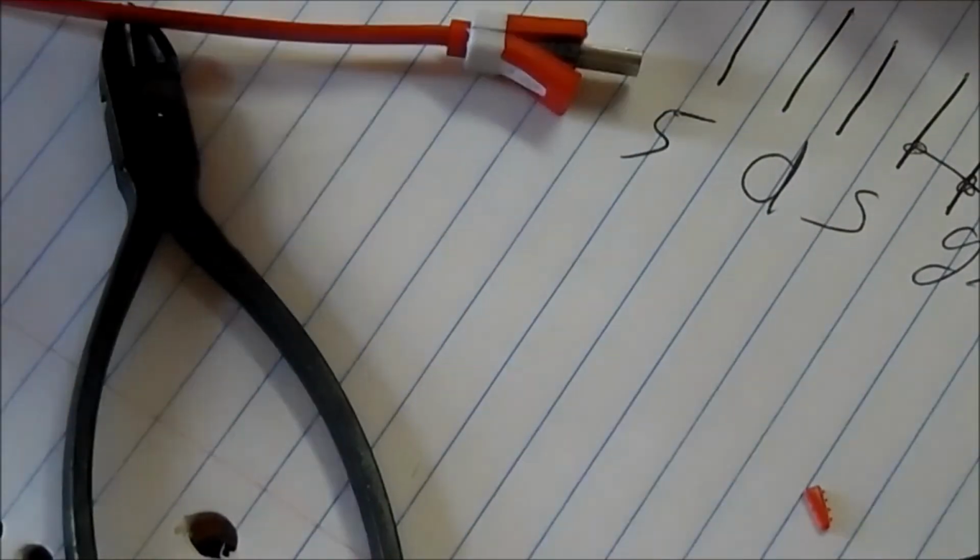That is weird. So we do have color coding. Just going to double check and make sure it's the right color. Like I said, once you find ground, you found all of them. Ground is far left, so ground is gray. Then we have green next to it, which we have, and then white next to that, which we have, and then red next to that. So this is actually color coded. That is weird as hell. It's just so very faint. Wow.